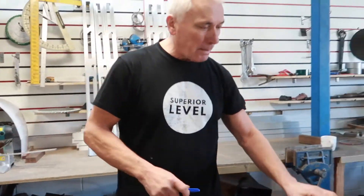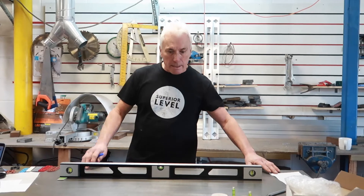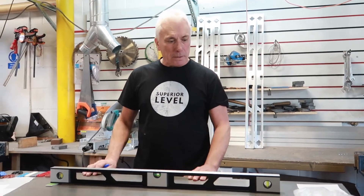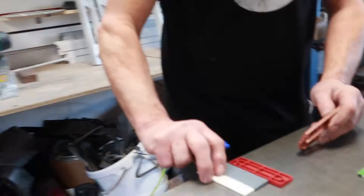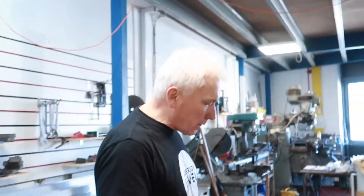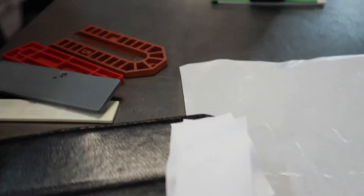You're going to need a couple of things to check your spirit level. You're going to want a flat clean area that you can put a mark on. If you're working in a kitchen and you want to quickly check your level, a work top is fine. You're going to want a few packers because if it isn't level you're going to want to put some packers in underneath the spirit level. And you're going to want a marker, a pencil, your cell phone — some post-it labels are best — and I'll explain why we need those in a minute.